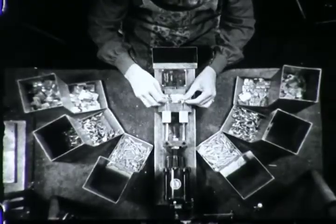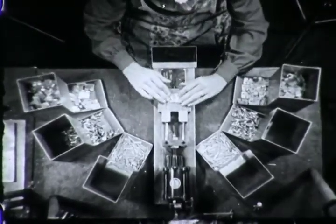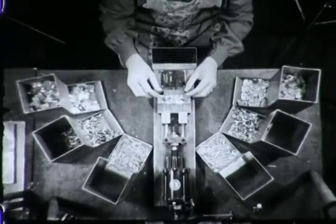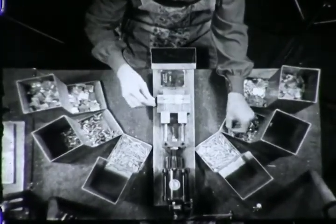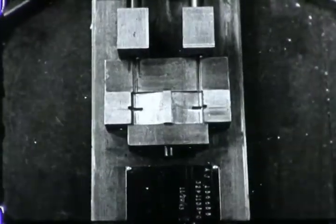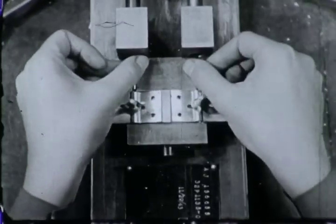Now both hands are at work on the hinge assembly. This air-operated fixture properly holds the hinge, eye bolt, and pin. The left and right hands locate duplicate parts simultaneously. A foot pedal actuates the air cylinder and a drop delivery chute disposes of the completed parts to a tote pan below the bench. In the spring and cable, fuse and hinge assemblies you have just seen, the one-arm bandits have been eliminated by applying a horse-sense principle of motion economy: both hands should work together.